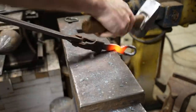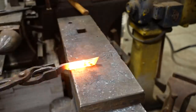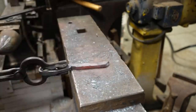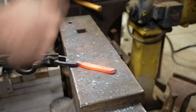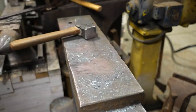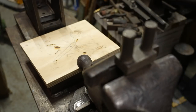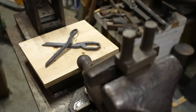I went a little far on that second shoulder — it's a little too deep, and it's really the only thing I don't like about how these came out in the end, but overall they're still pretty good in my eyes. Carefully drawing out that blade section and getting it nice and hot so that I can draw it out a little bit longer and flatter so that it's easier to grind once I get it to the final length. A little more bending over on that jig to try to get the shape just perfect, and then I wind up with two halves of the scissor that are pretty close in their rough forging.